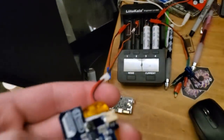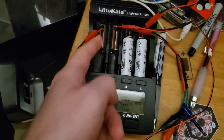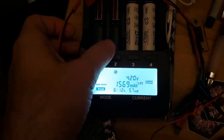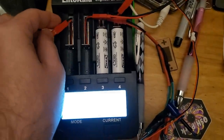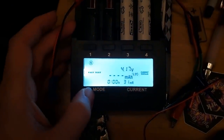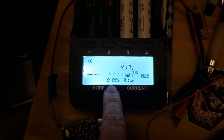As you can see, this is plugged in right there. Channel 2, channel 1, these aren't switched internally. If I unplug this, I now no longer have a channel 1, just have channel 2. So, I'm going to plug this back in. And now it's redetecting my battery. We'll put it over, run one more test. Let's do 700 milliamps this time. We'll wait for that to lock in.